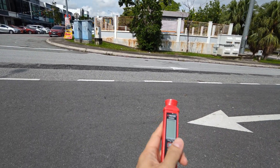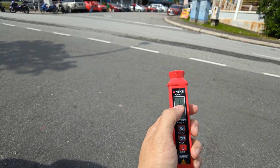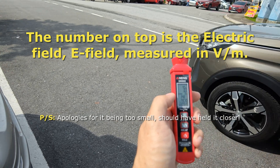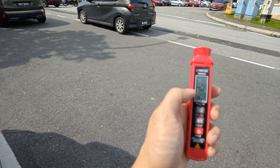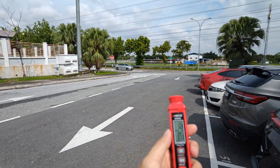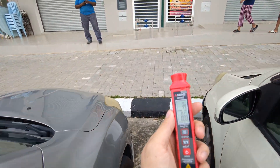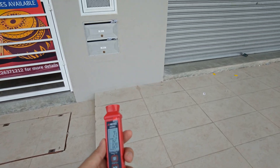This is my device — I'll power it on. The top reading is E field — you can see V/m, which is the electric field. The bottom reading is H field — that's your magnetic field in micro Tesla. Right now it reads 55 and 0.5. If I walk in different directions, you'll see it change. It varies significantly as you get closer to a source.